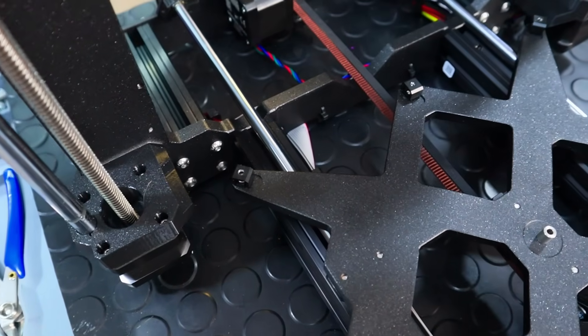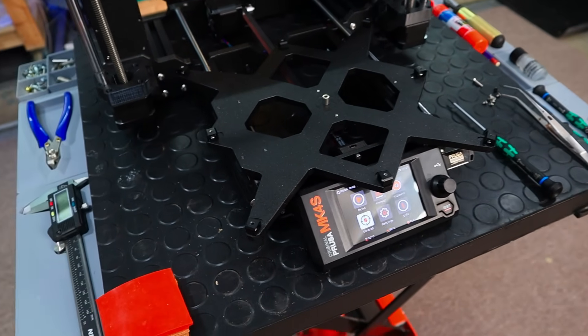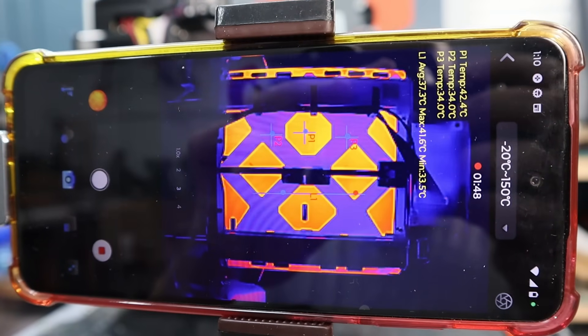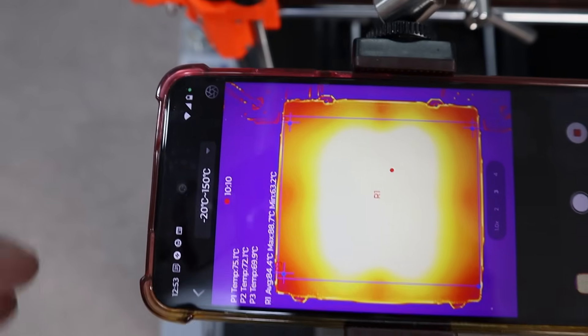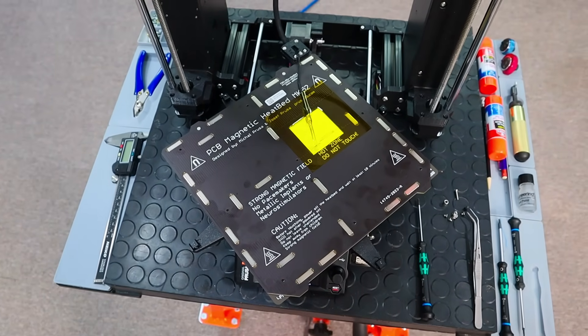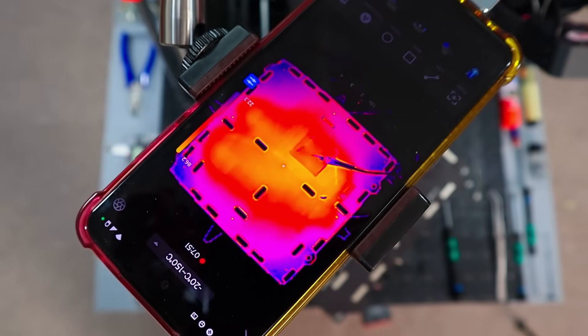The aluminum standoffs look like they're acting as mini heat sinks — likely absorbing heat and distributing it into the aluminum X-frame below the heat bed, effectively making it one giant heat sink. The max bed temperature reading I was getting was 88.6 degrees when it should be closer to 100. The thermistor is attached to the bottom of the heat bed, covered with aluminum foil then Kapton tape, and it seems to be reaching 100 too soon, causing the heater to turn off prematurely. The heat bed itself is not insulated and is radiating heat from below. The magnet placement combined with screw holes and aluminum standoffs are all contributing to those cold spots — seven reasons in total.